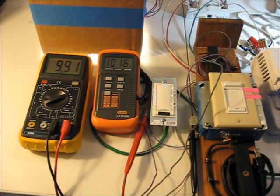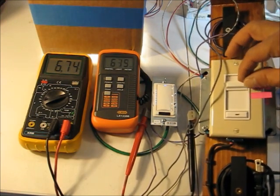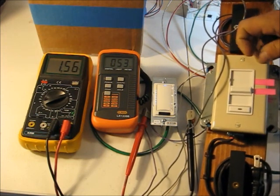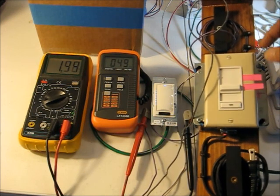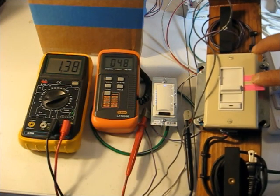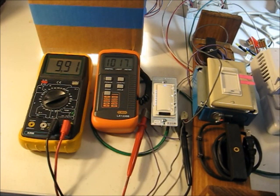And you can see that the actual dimming range, the effective dimming range on this dimmer, is basically between there and there. And this only takes it down 1/100th of the output. So not really an effective thing. So that's actually the effective high quality range on this dimmer. And this one cannot be tweaked like the digital dimmer. So that's the beauty part of a digital system like this, with a 0 to 10 volt ballast or driver.